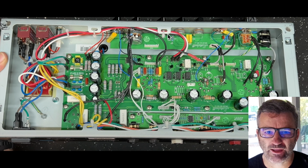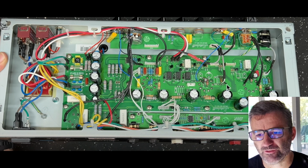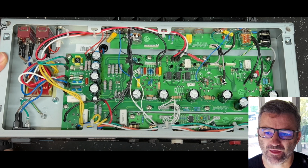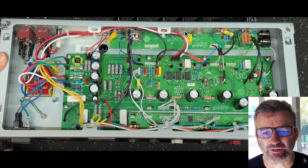The tone stack no longer had a ground reference, and the way that I achieved that was this guy here, which runs off the 100k cathode resistor, which is part of the mod. This black wire here, that's your ground. So strip the PVC off the wire here, and solder that onto the ground point right there. That'll give you a ground reference on to your EQ.